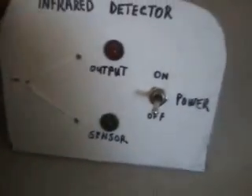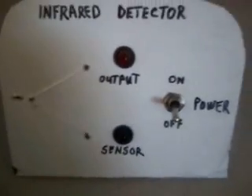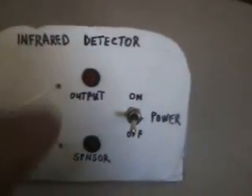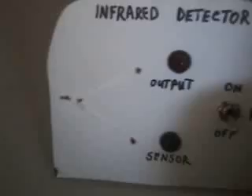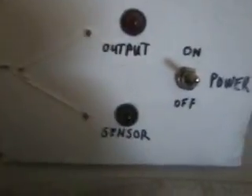And the LED on the top, and the power switch, and so on. It's a very, very simple circuit, and this will detect infrared from remote controls, or infrared LEDs that you may have in your stock that you're not sure are good or not. This thing's not very sensitive because it doesn't actually have an amplifier for the infrared input, but it does work at close proximity. With remote controls it'll work up to about five feet, even without amplification.